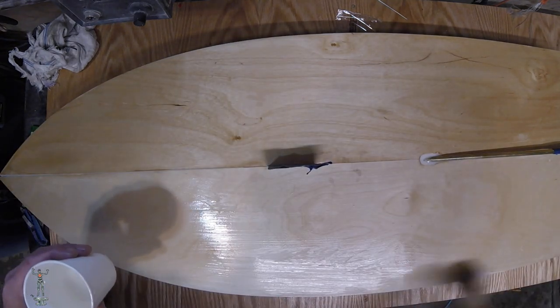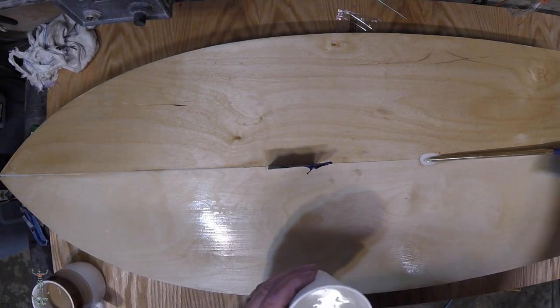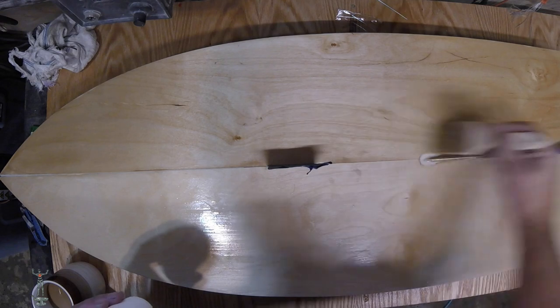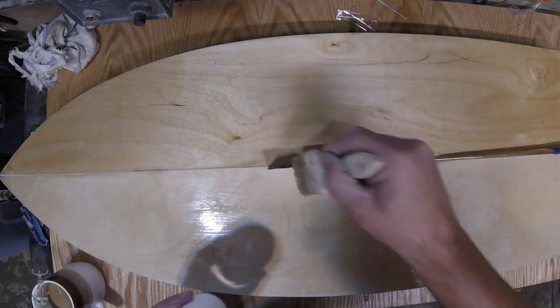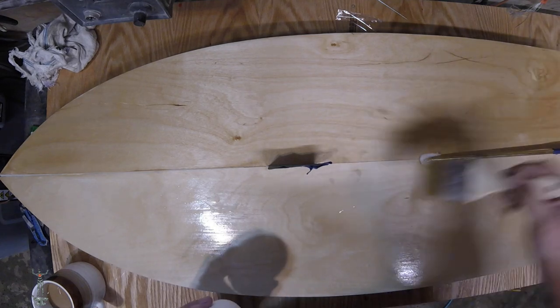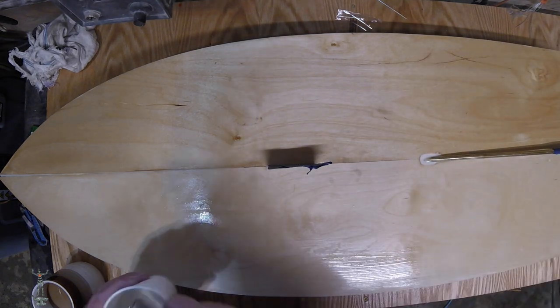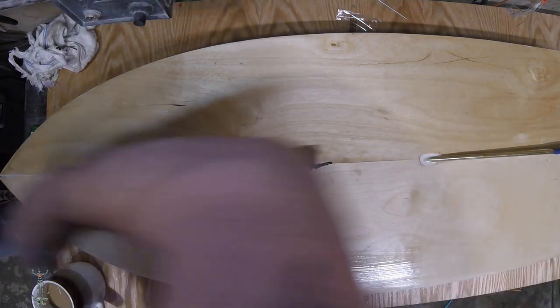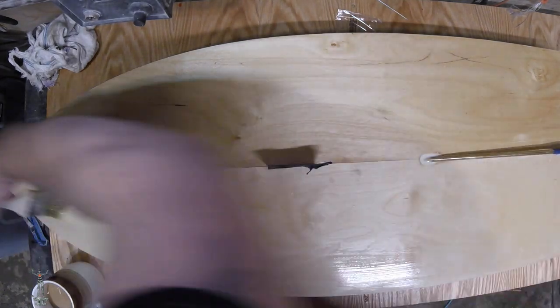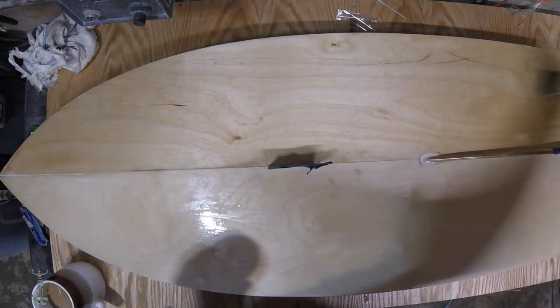Okay. And it will get tacky, but tape up anything you don't want. This tape on the skeg and the rear of the shaft tube, that tape's staying there throughout the paint job. But we're going to do an orbital sand on this with 600, probably. You're going to actually be taking a lot of this off, but what it is going to do is fill in any pores.